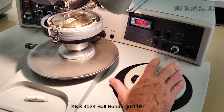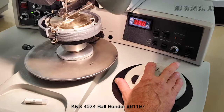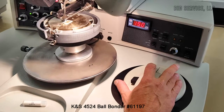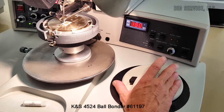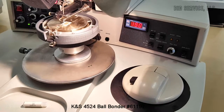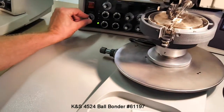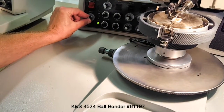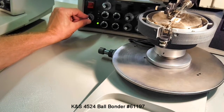The left push button here is your operation. Let's say we want to go to search one — I'll press and hold, now we're at search one, and as you release that, bond one is formed and now it's up at loop. Loop can be adjusted by your loop knob over here. If you look you can see that the head is moving up and down, so you set your loop height there.